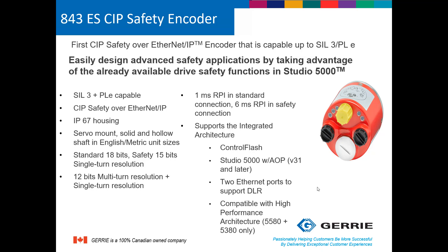There are single or multi-turn resolutions and pulse configurations available. The device itself is an absolute encoder, meaning if power is lost to the encoder, it will not lose its positioning. In order to configure this device, ProposalWorks can walk you through the steps. In order to communicate to this device, you need to ensure that you're using the most up-to-date Studio 5000 software, usually version 31 or later, and that you have downloaded the add-on profiles in order to set up communication.